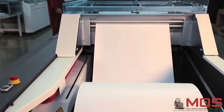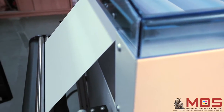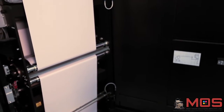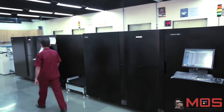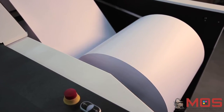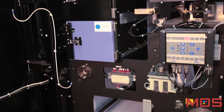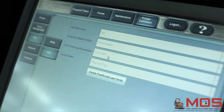First, a paper roll is fed into the Ricoh IP5000 inkjet using the unwinder. The Ricoh IP5000 inkjet is a state-of-the-art printing machine consisting of two printing units that allow it to print duplex color variable matter onto a paper roll having a width of 20 inches. The two printing units each contain the CMYK color chambers and they can print with a resolution of up to 720 by 360 dpi.